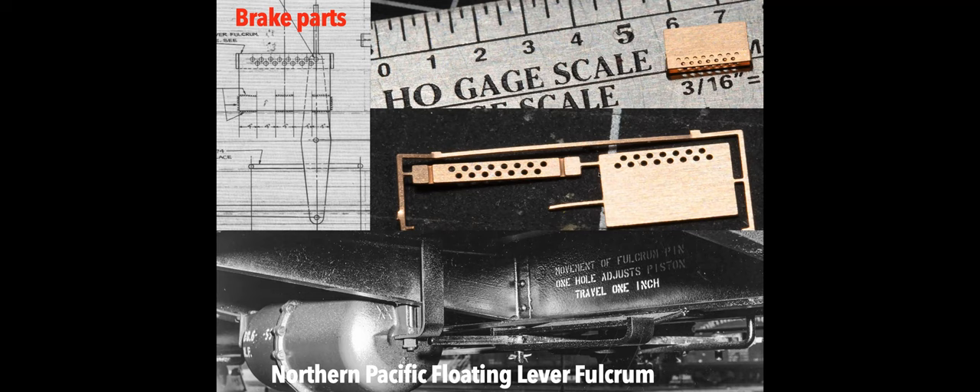Here's a drawing of the part, and here are the two pieces etched. The piece on top is just this part folded along those half-etched score lines, and underneath it is the second piece. Here is where it was on the car — I'll have to make a little bend because part of it was welded to the bottom of the center sill, then had a slight slope, then flattened back out, and then there's that rounded part. I'm really happy with the way this particular part came out.